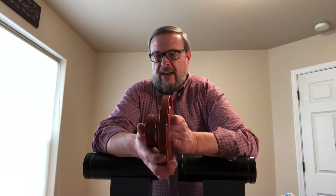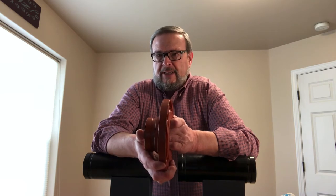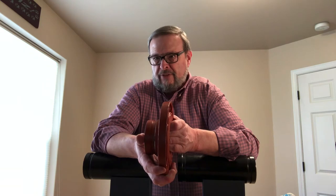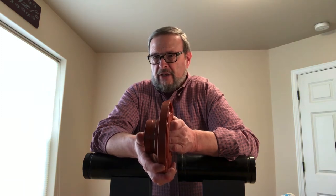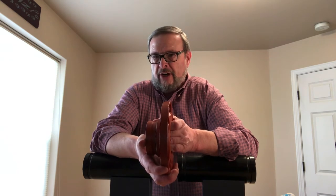This part I'm holding in my hand is their flange adapter figure 7788. Anytime you have a groove piping system it's going to have to terminate at a piece of equipment or a valve, and it's usually that piece of equipment or valve that's going to have a flange on it. So you want to be able to connect to that and still use a groove coupling to connect your piping system to it.